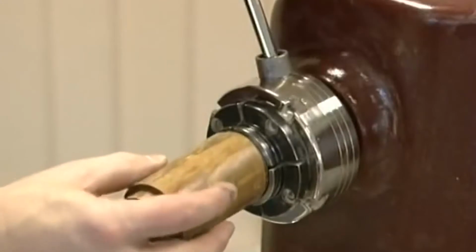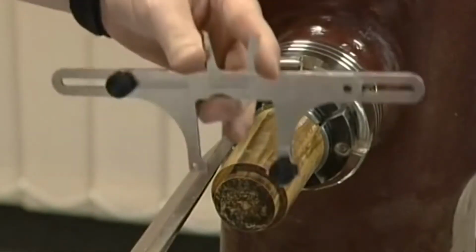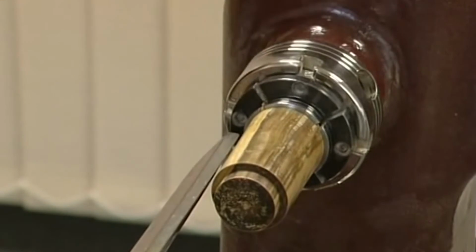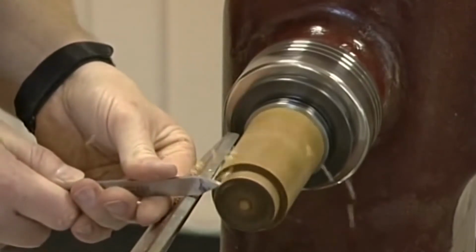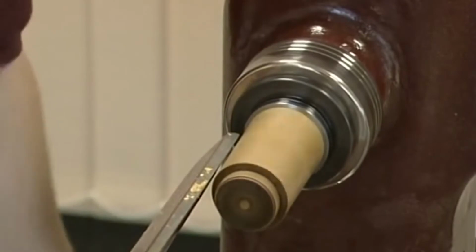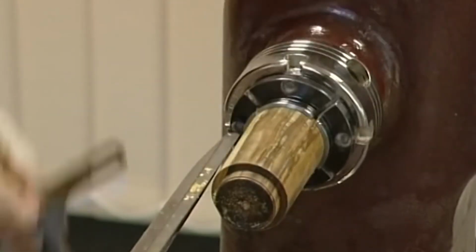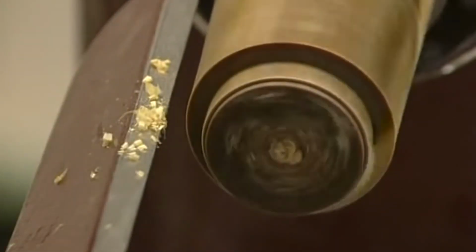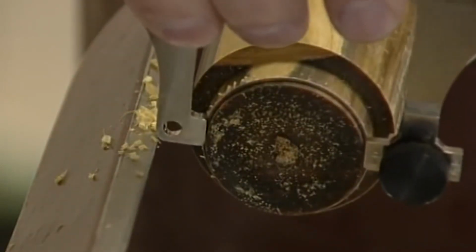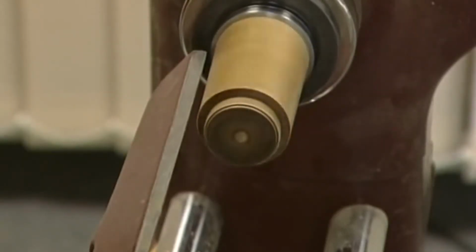Once you are satisfied with your thread, remove the lid from the chuck and in its place mount the base. Use the special calipers to measure the spigot. A parting tool is being used to ensure the shoulder is square and clean. The parting tool creates the recess ready for the thread.